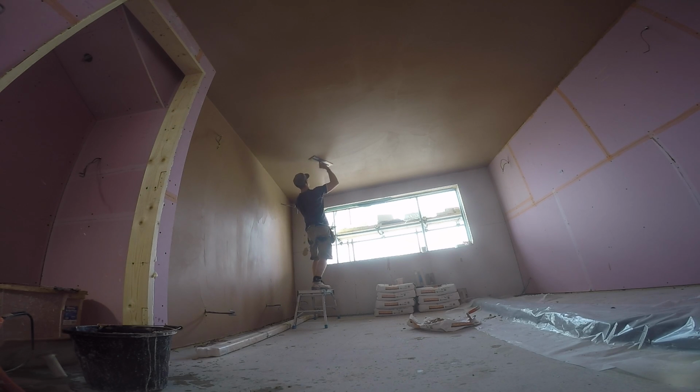So it's stage 3. It's been an hour and 5 minutes now. First trowel over. Still using Marshalltown. Some people might go to a Superflex trowel, for example, but I stick to the Marshalltown until the second trowel over, really. At this point, I don't need any water, but we will get to that next stage. But it's still quite wet. I'm just troweling any lines out, and you can see making it smoother.